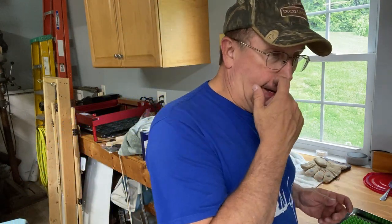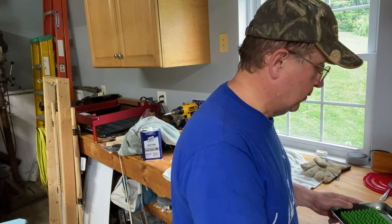Working right now with powder coating - it's springtime, it's raining all the time, air-conditioning is not running. 40% humidity has always been the rule for shake-and-bake powder coating so you can develop static. Since wintertime on the wood stove I just haven't been able to get there for months. It's 40% humidity today and I think I got a little better result - we'll see how it works.